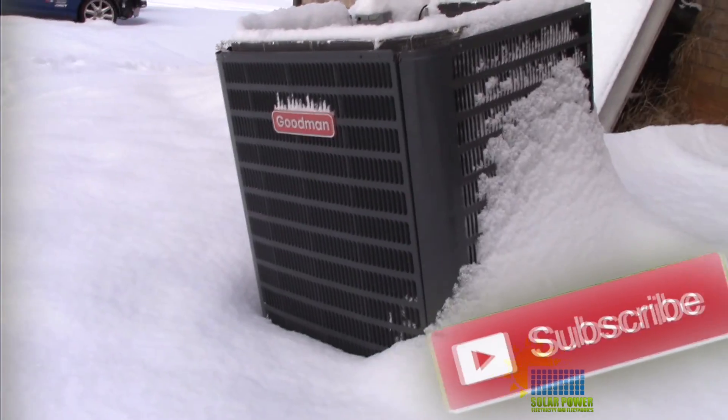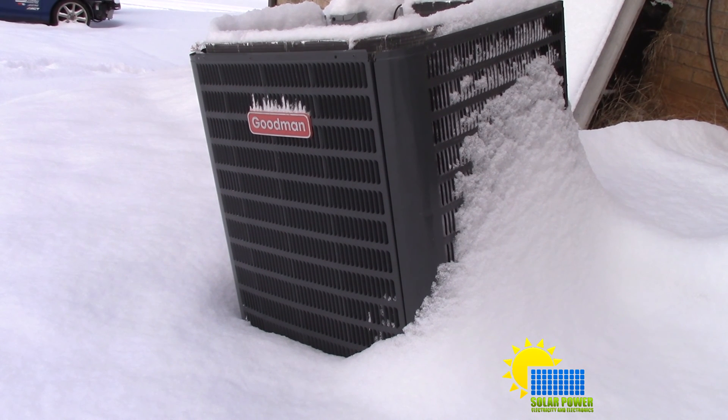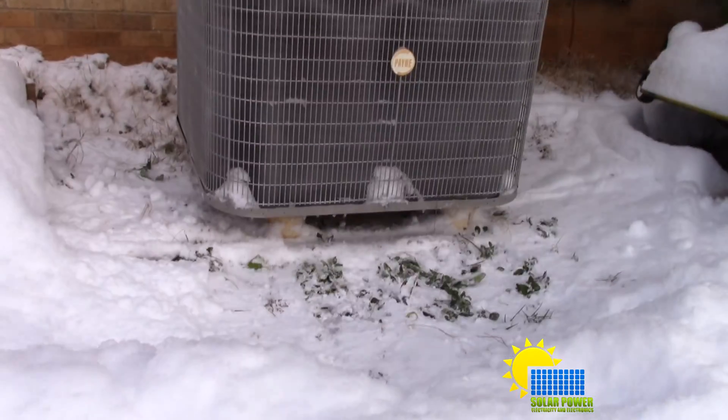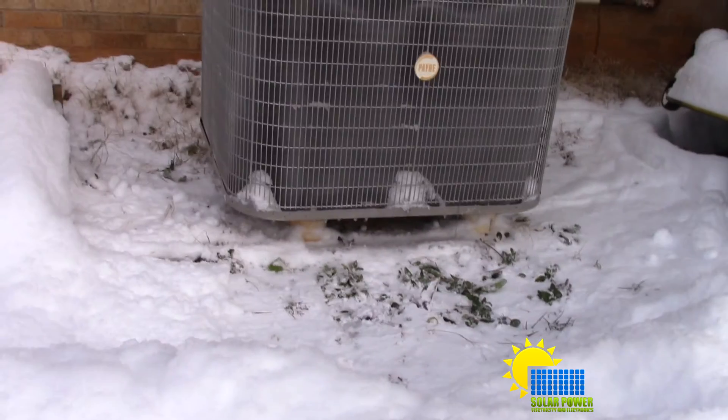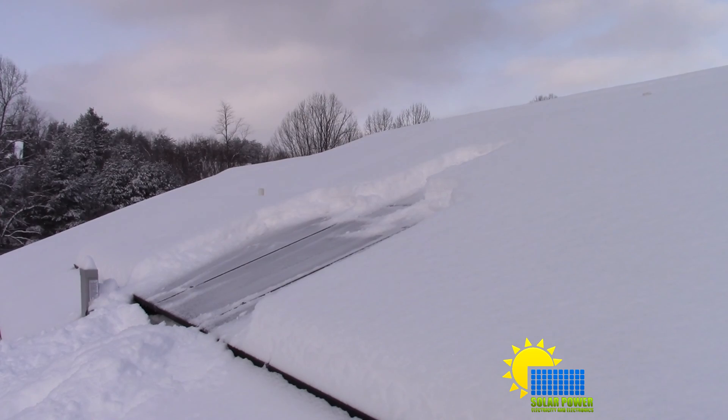That's not a functioning unit — that's just an old piece of junk I got out of a burning house. Well, it's not old, it's actually a new piece of junk, but it came out of a burning house. You can see the snow building up on the coils — your unit has to melt that off, and it takes heat from inside your house to do it. So clear out the snow real quick.